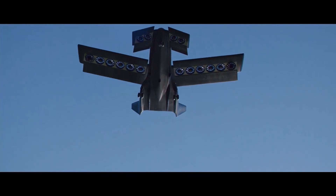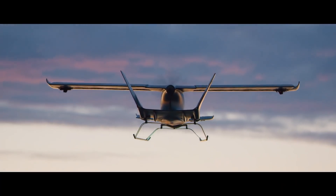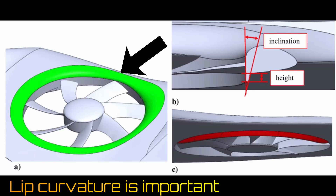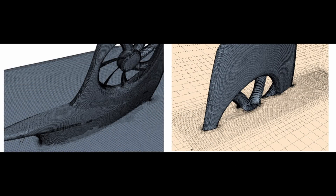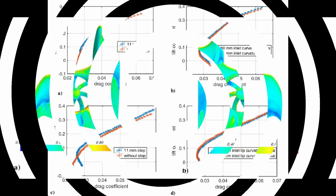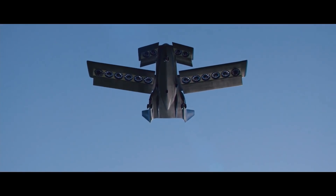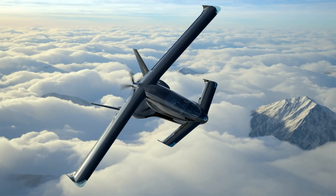It has to be noted that if the inlet in a wing-embedded lifting rotor is open, then the lip curvature on the wing at the edge of the rotor cavity plays an important role in performance. A study showed that a step on the lower side of the wing in front of the lifting fan duct increases the lift-to-drag ratio by up to 25% for all positive angles of attack. Different sizes and inclinations of the step had limited influence on the surface pressure distribution. The data indicates that these parameters can be optimized to maximize the lift-to-drag ratio. An even better solution is to have the wings split open during hovering mode to expose the lifting fan, and close during cruise mode, thereby concealing the fan completely and making a smooth wing surface.